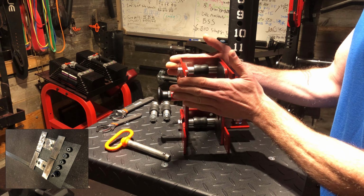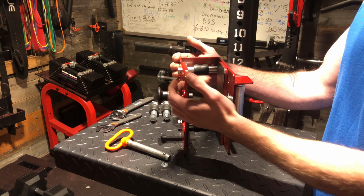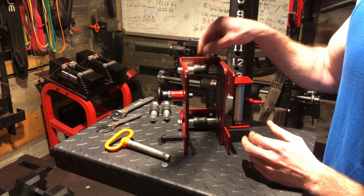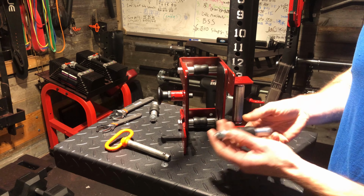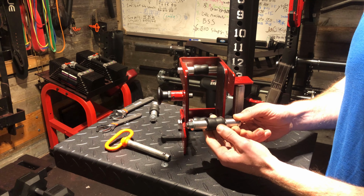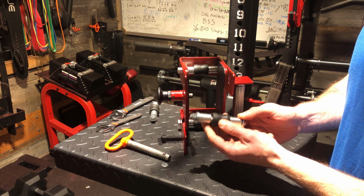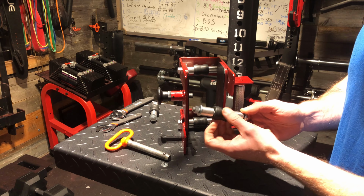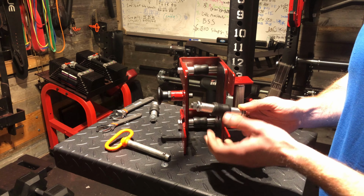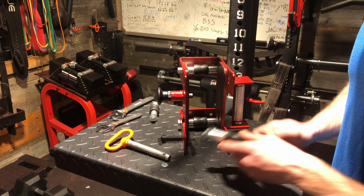made sure that when I put it up onto my upright, I had enough clearance to drill holes in the side of each one of them to make sure that I could get these rollers through. This is just a bolt, spacers, washers, and then these roller systems. It took me the longest time to find what I was going to use for these, because I didn't want to use plastic rollers. I wanted a rubber roller that would kind of stick to the upright when you're rolling it, but also move very well, and I'll have the link for that down there in the description.